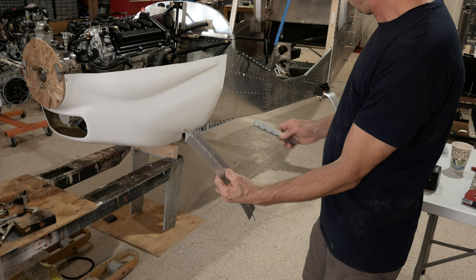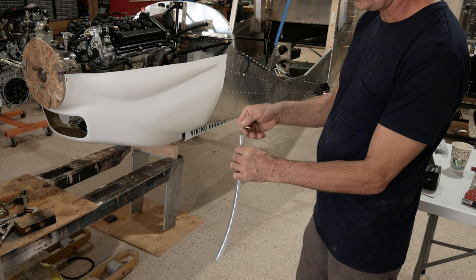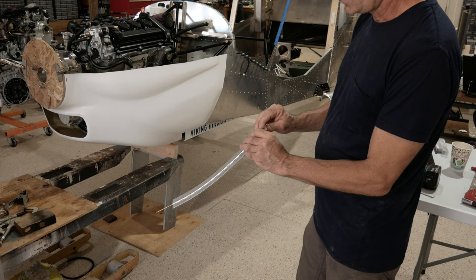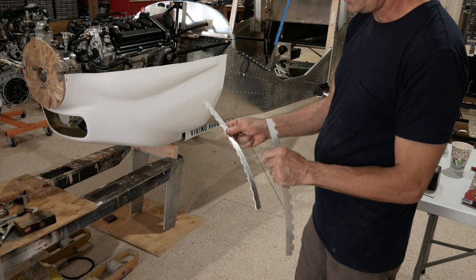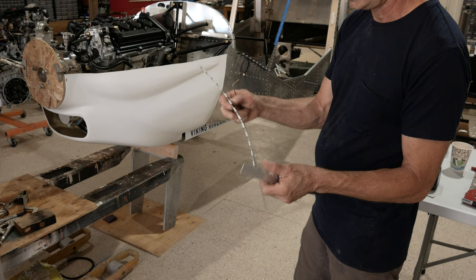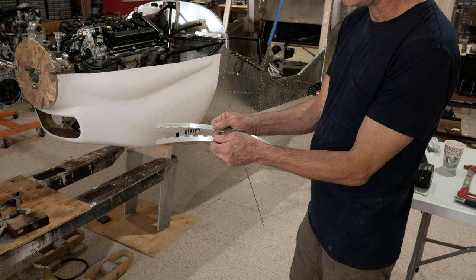So all you have to do is flip one of the two, and then we're going to bend it to fit the airplane. After we bend it, you're going to feel that it's harder to move the pin. If it's not too bad, we're going to leave it alone. We might also just take this apart, and that's something that does work. You take one of these, and you just take away a little bit on each of these with a file, so that they can go together easier like this. Because right now it has to go very precisely for it to fit. Once we get a little bit of that filed away, then this will go together much easier.